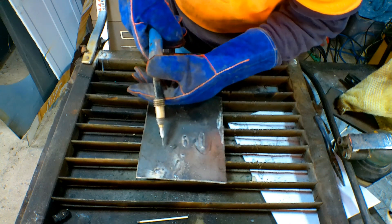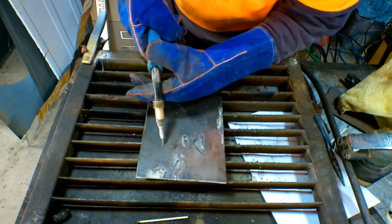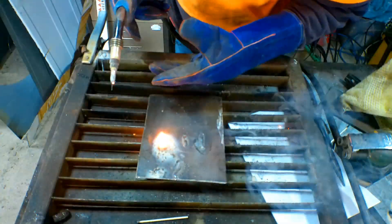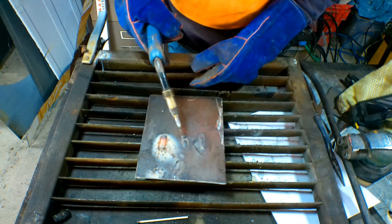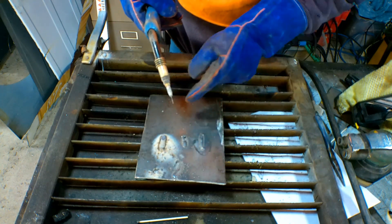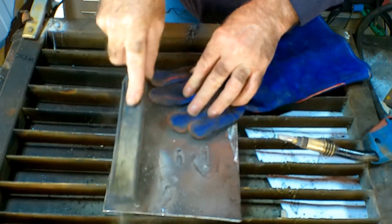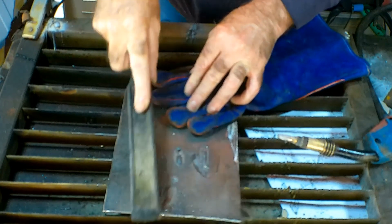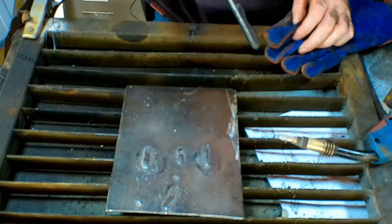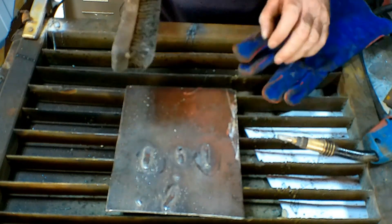Negative electrode again guys — see how I burn through that. Now I've changed it back to positive electrode — watch the amount of splatter and see if it burns through like before, because there's not as much heat. See that splatter there compared to the other side? When the clamp is positive, you're getting more heat on your work and less heat on your wire. All that splatter versus virtually no splatter — that's just the difference in changing the polarity.